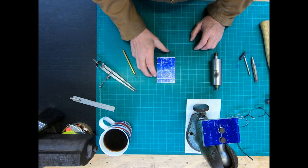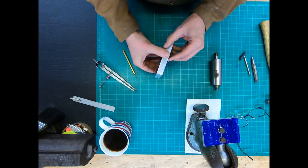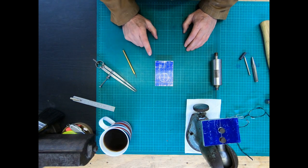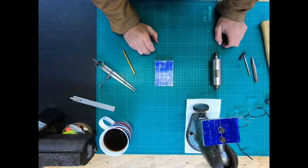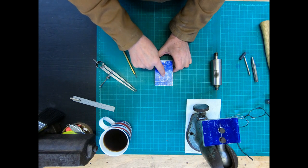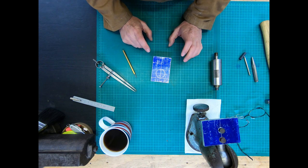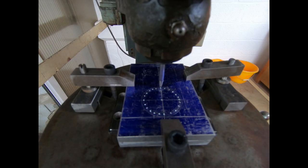That's really where we are at the moment. I hope I can get this super glue off — I've never tried it before and I think I may have put too much on, but that's a problem for later. What I'm going to do now is drill this on the jig borer because we've got the rotary table, so I can set it up on center, move it back, and we should be fine. Let me go and set it up on the jig borer.